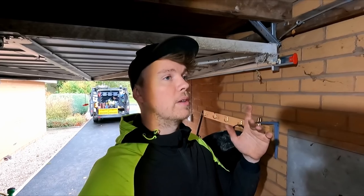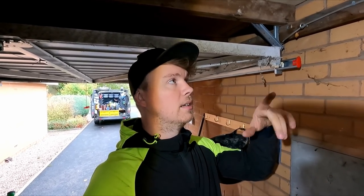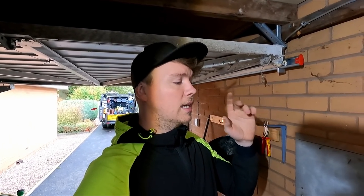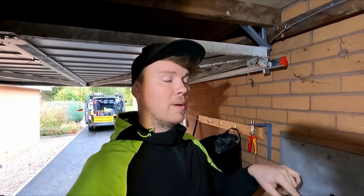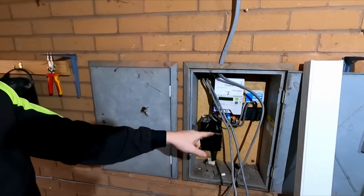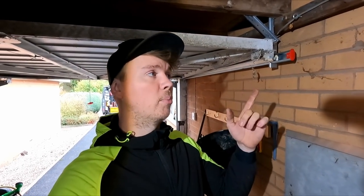But here we won't be. If we're moving the board, it's going to be literally through the loft space. So technically it's not within the fabric of the building. It's not drilled through a wall or hidden with plaster work. It's visible. But I'm going to stick a KMF switch in below in the box here. We'll feed from the Henley blocks into the main, into the KMF switch, and then up.